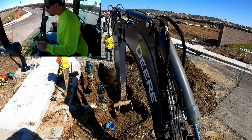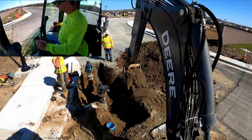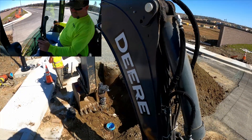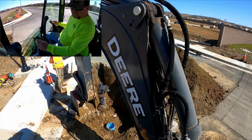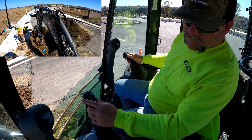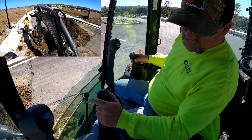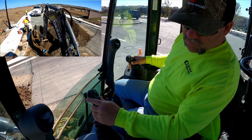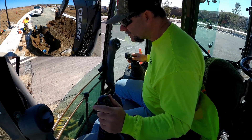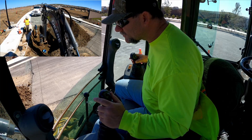At this point I've already exposed the far tie-in point and now we're working on the side closest to the main road. The whole purpose of these is to separate the existing line from the new lines going into the housing track — we don't want to contaminate the existing lines in the streets that are live and feeding other homes. The backflow prevents any contamination going backwards into the public side and keeps everything on the private side. It also allows us to feed and load the line — we inject chlorine to chlorinate and decontaminate all the lines we've installed.